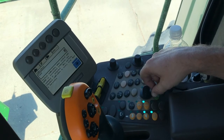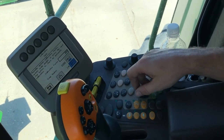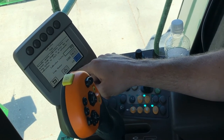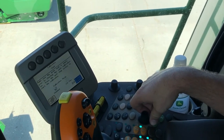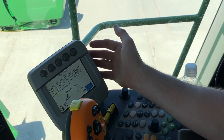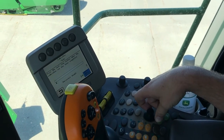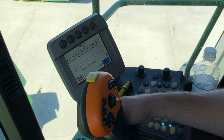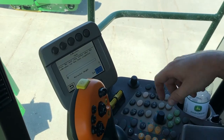You might calibrate your yield if your combine is showing a yield that you know is off, or if you're just looking to have a more accurate yield reading. We've got three buttons across the bottom — this button will take us back to the previous screen. If we have a load that has already been collected but we haven't applied it to our calibration, we can do that as well. If we hit the next arrow, it's going to start a new calibration. We've got calibration mode standard or low flow — in high yielding corn, if you needed to do a low flow calibration you would just adjust your speed back to have a lower flow coming through the machine. At this point we would start harvesting. We can see a bar graph that will show as we're collecting grain and then show our harvested weight. We have to have 3,000 pounds of harvested weight before we can continue and finish our yield calibration — it will not let you finish until then and it will tell you it failed.